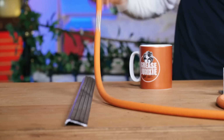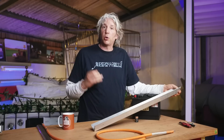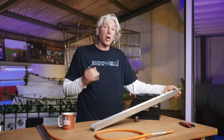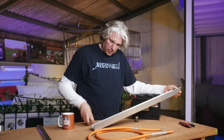Now obviously at 60 volts, if you are wearing gloves, I'll just pop that little barrier in there, then it's back to being a different matter. You're completely protected, so your skin doesn't even get a look in because the gloves get there first, which is why it's so important to wear the right spec glove for the job in hand and for the voltage that you're dealing with.